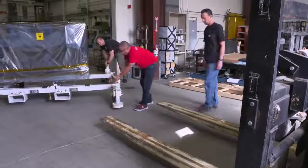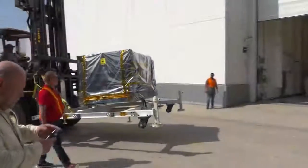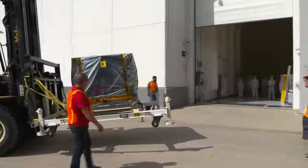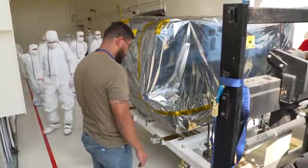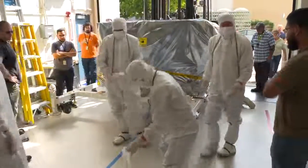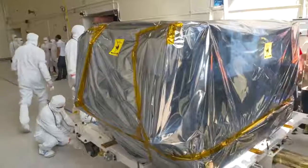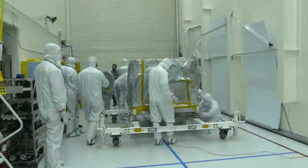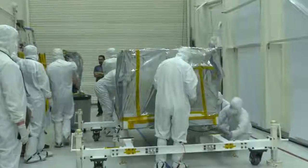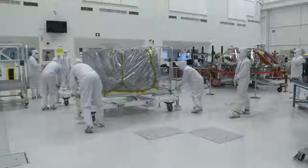After the baking, we need only to deliver it to the assembly facility. We have to keep it clean, so we put it in a double bag. When we get to the assembly building, there's a room called an airlock, where we transition from the dirty outside to the clean inside of the assembly facility. We very carefully clean portions of the fixture that are going to touch areas inside the airlock. The outer bag got dirty outside, so we take that off and throw it away, and the bag inside is relatively clean.